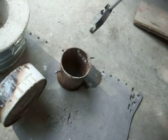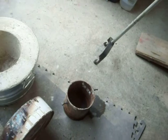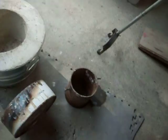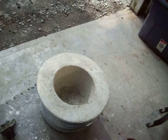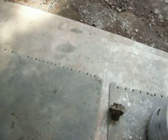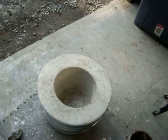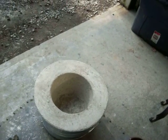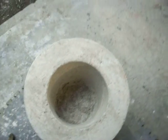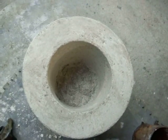After I mixed it up it was about two or three inches from the bottom. I took the red bucket and pushed it down into it until the mix on the side was up to the top. That bucket was a perfect size for my crucible - I actually figured it out. That gave me just the right amount of room to get the crucible in there. Then I left it to set up. Once it set, I took my block and tackle, hooked it to the handle of the red bucket, lifted it about a half an inch off the ground, put a rubber mat underneath it, tapped the bucket after about an hour, and the bucket pulled right out of there and gave me a pretty nice finish. I also want to drill a hole through the bottom with a hole saw in case the crucible fails.